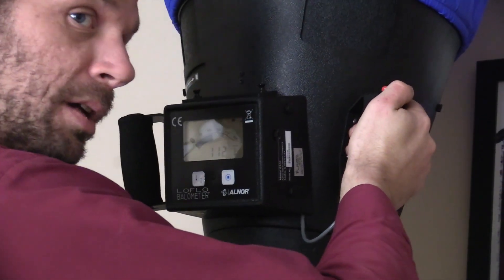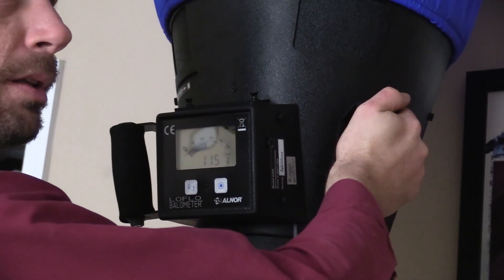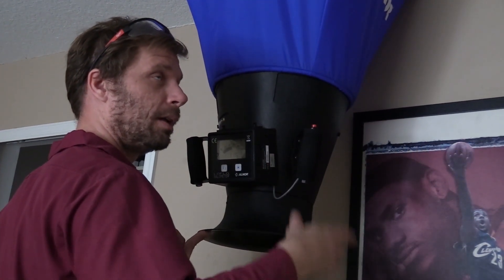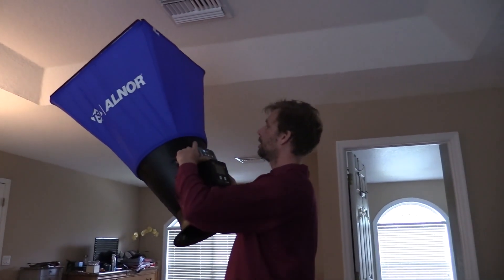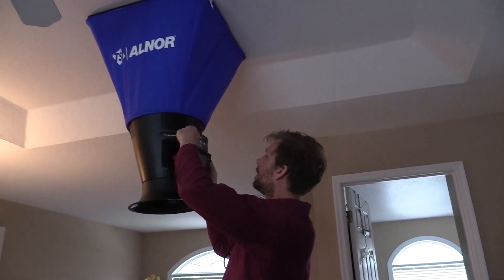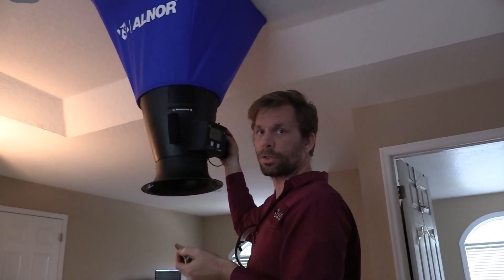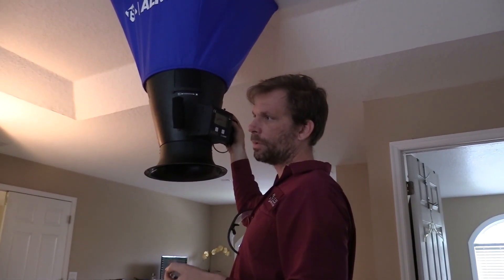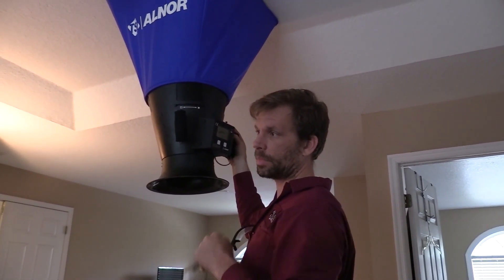You can already see some balancing to do here. This is a corner wall, so there's going to be more heat. It also has a TV in the room. The other one has an insulated wall on each side and it's currently getting more airflow than this space. So this room in particular, we had a lot more CFM than we needed — we oversized in the master bedroom and we put dampers in because you can always damper down. It gives you full control when you oversize a little bit and put dampers in.